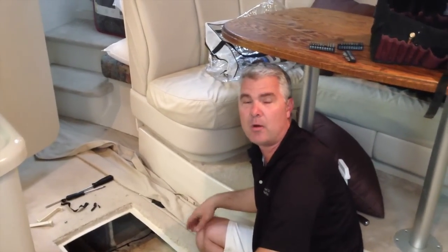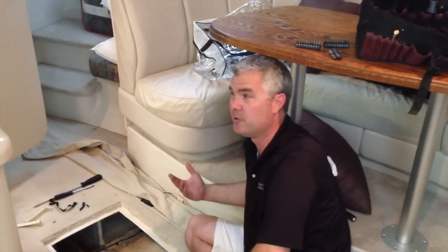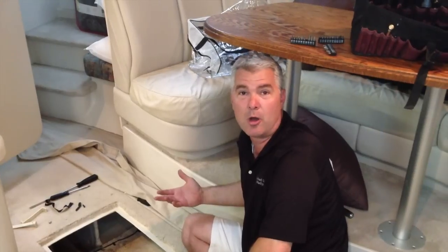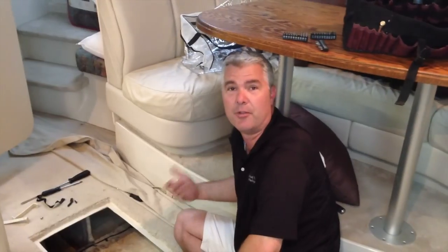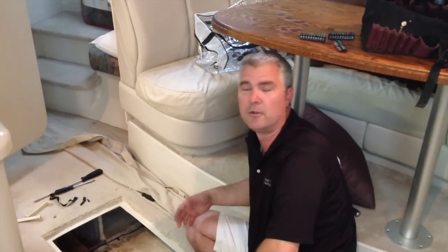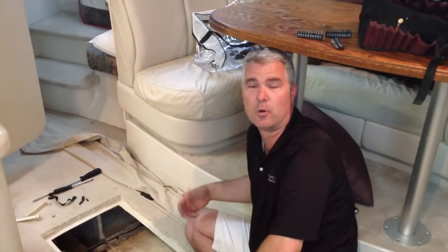This has to do with the shower sump pump. These things don't last forever. All they do is they run off a bilge pump inside of a tank to pump overboard. When you take a shower inside your head, the water goes down into a pump and then it pumps it overboard. It's designed strictly for shower water. I'm going to show you exactly how this one's done — these are very similar in a lot of boats. This one was completely shot, actually full of junk and the bilge pump was frozen. So I'm going to show you what we've got so you know what to look for when you want to replace it on your boat.